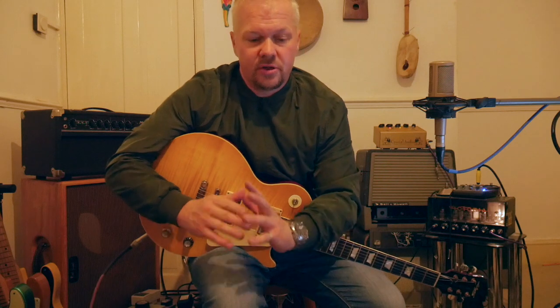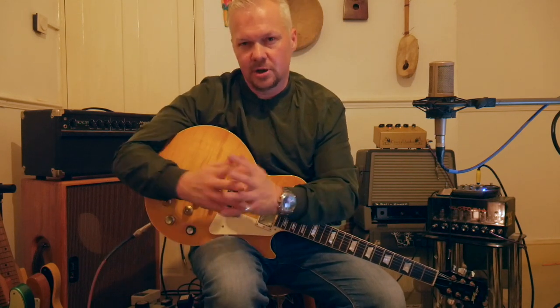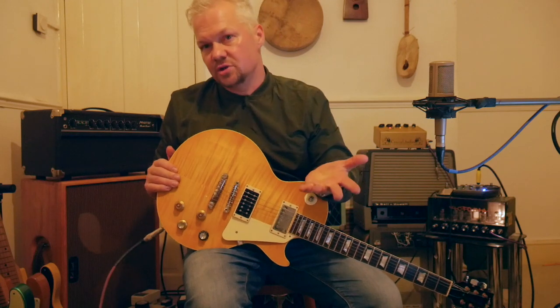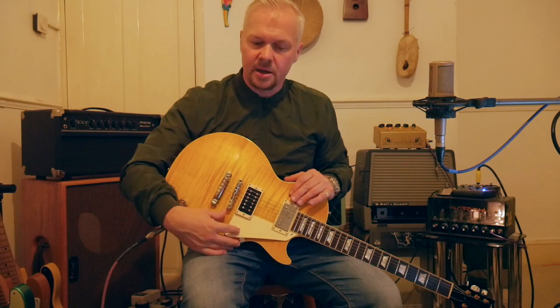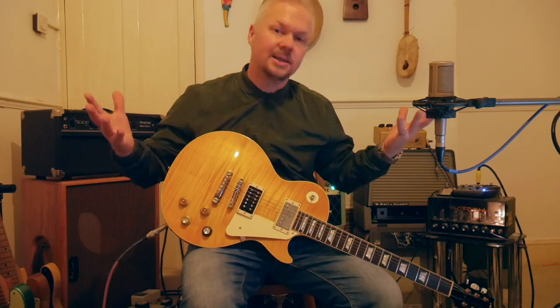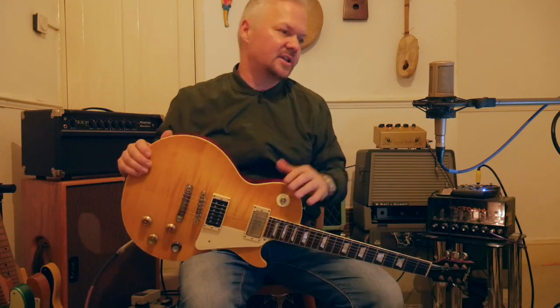And the values of these are between 530k and 550k, because that's what the old ones measured. They kind of drifted a bit, whereas if you buy a modern set of CTS Mojos, I think they're called, they will be, say, 500k. So that's another thing you might want to change. Check out VIP Pots. They should give me an endorsement for this. Check out VIP Pots, because they are the closest ones, apparently, to the Centralab original pots they used in the late 50s.